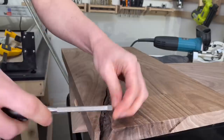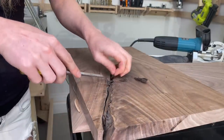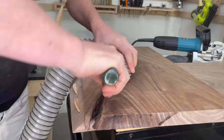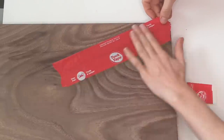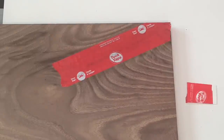I have this beautiful natural crack in the wood. My plan is to clean it out and fill it in with resin. Take a chisel to clean out all the soft pieces — a vacuum cleaner is helpful too. Since the crack goes all the way through, I will have to tape off the bottom and the sides to contain the resin. Make sure to double layer the tape so none of the resin leaks out.